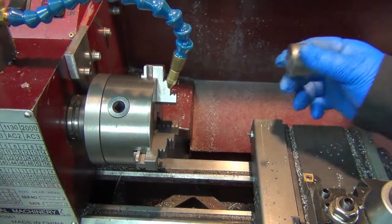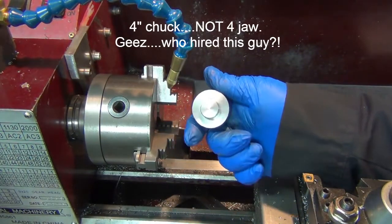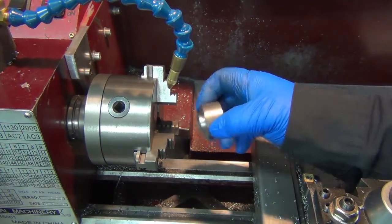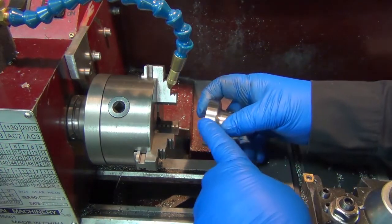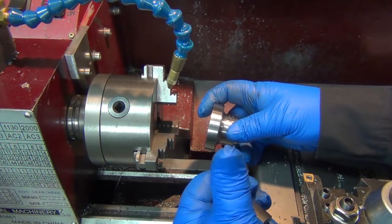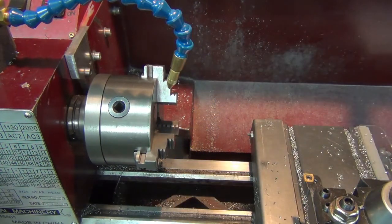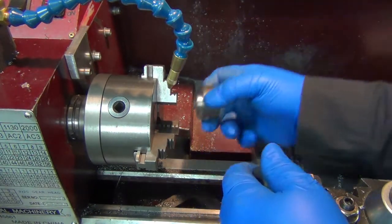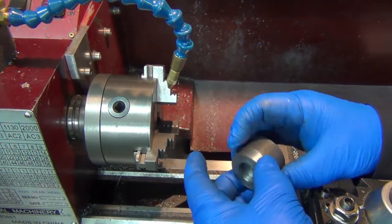I got the other parts pretty well dialed in, so I decided while I had the four-jaw chuck in, I would work on a couple of the others that need the four-jaw chuck. Once I established and got this dimension correct, I was able to mock it up on the spindle with the rotor and the hub again, get my exact dimension. It turns out it's the same dimension I was working with before — it's 0.550 — so now that it's verified I can cut the backsides.